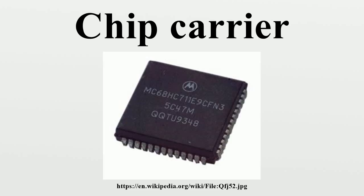The JEDEC Trade Group started a task force in 1981 to categorize PLCCs, with the M0047 standard released in 1984 for square packages and the M0052 standard released in 1985 for rectangular packages. The PLCC utilizes a J lead with pin spacings of 0.05 inches. The metal strip forming the lead is wrapped around and under the edge of the package, resembling the letter J in cross section.